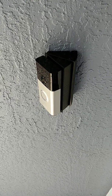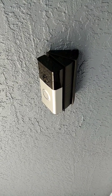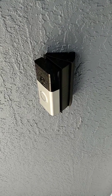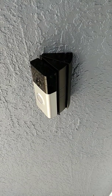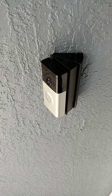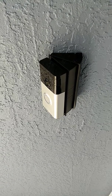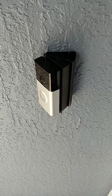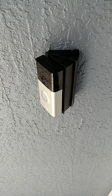What I did to solve this problem was to get some sandpaper and sand down the wire leads. Make sure that they are shiny, then simply reconnect the wires back to the doorbell mount, press the button on the doorbell to reset to hardwire.